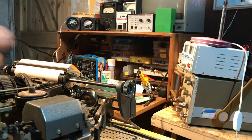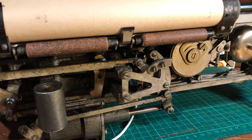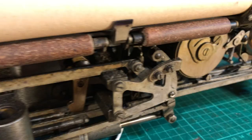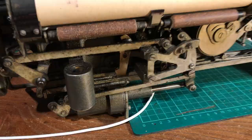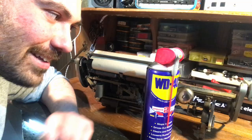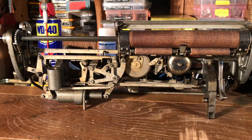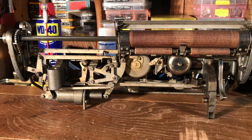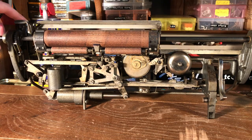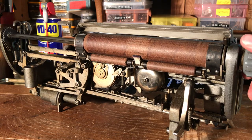So the first part I'm going to remove and clean is the carriage — it comes off really easily, it's so well designed. It's got a little lever down here, you move that across, it swings out and then you can just lift the whole thing off. You can see this thing's really got quite a coating of grime and dirt on it, so I'm going to clean that off as much as I can, especially near all the moving parts, and re-lubricate it. It might require some disassembly, but I'm going to try and do as little as possible. Moving this back, you can see there's a little pneumatic piston here, and it all moves nicely. The bell mechanism works, and the carriage return and line feed are working beautifully. Nothing seems to be seized — just needs a good re-oil and clean.